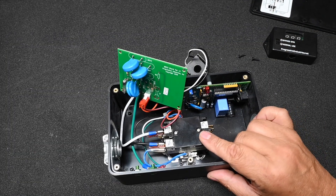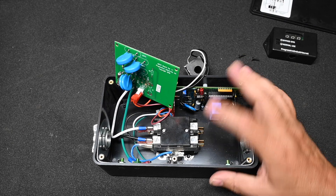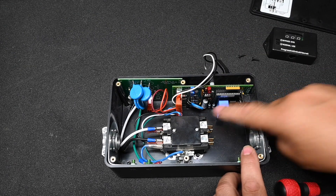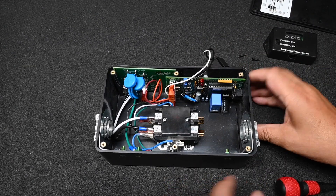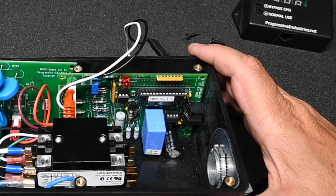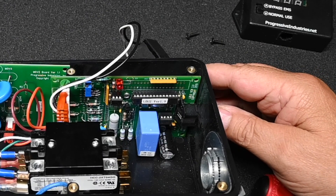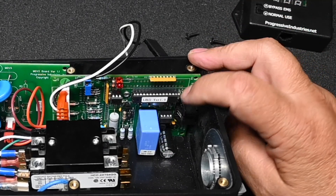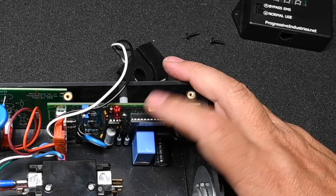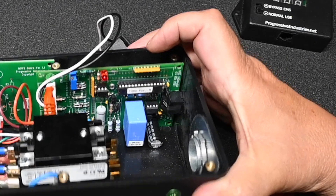The contactor is just a switch. When the control board decides that the power meets the requirements, it will close the switch and power the RV. There's actually another MOV on the control board, and I suspect that MOV is to protect the control board itself. We also see the marking LBU2 version 1.9 — I'm going to guess that is a microcontroller of some kind, probably a PIC. With a label on the cover, we really can't tell. So this box is under firmware control. We also have an adjustment here that doesn't state what it's for, so I'm not going to mess with it.